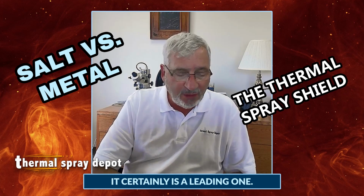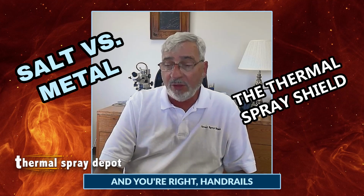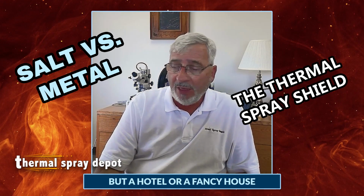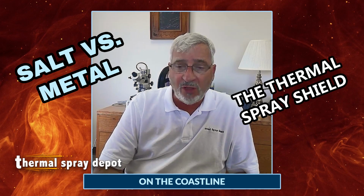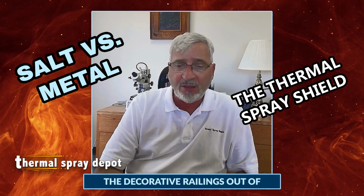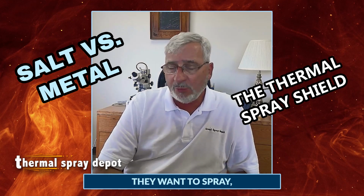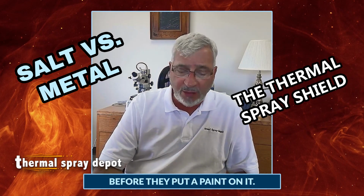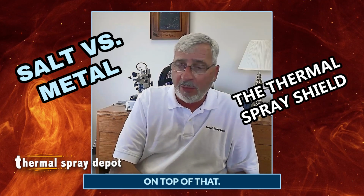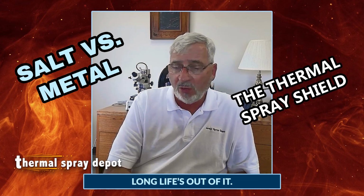It certainly is a leading one. We get calls all the time for corrosion protection. And you're right, handrails, you don't think about it, but a hotel or a fancy house on the coastline has that salt water all the time. So oftentimes the wrought iron that they make the decorative railings and the outdoor staircases out of, they want to spray that with zinc before they put a paint on it. Once you spray it with the zinc, you can put epoxy paints and regular paints on top of that, and the zinc acts like a primer. So you get some really nice finishes and some long life out of it.